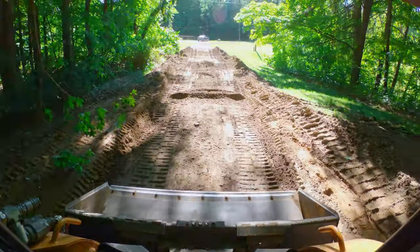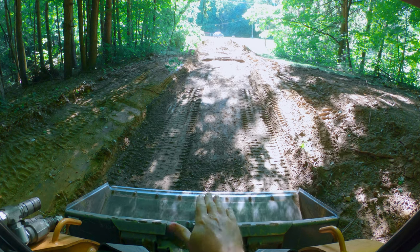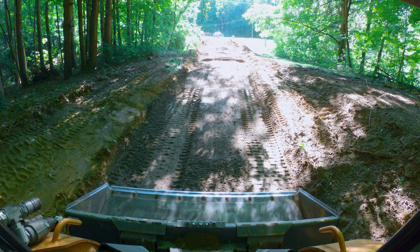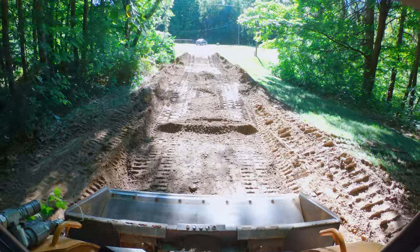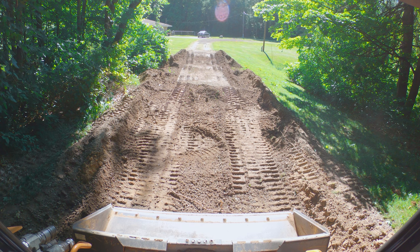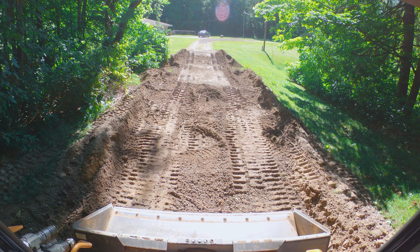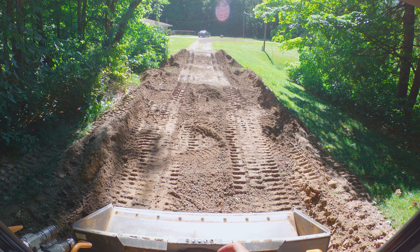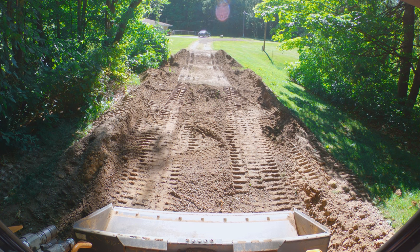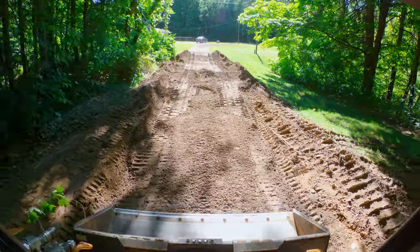Before I back drag, I want to show you guys — you can't even see where the transition point is now. You've got a couple little holes and a gentle dip where we shaved, but one back drag is all it's going to take to correct that. Now when you're back dragging, you want to make sure the float is turned off on your machine, because float allows the bucket to move all over and we don't want that while grading. With float off, I've got full down pressure and the blade tips just slightly down so the cutting edge is actually digging into some material — it works kind of like a land plane, rolling material back and filling holes.